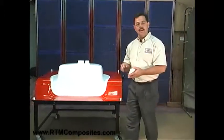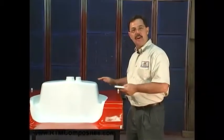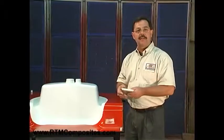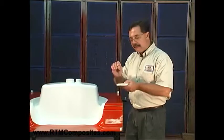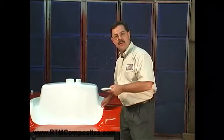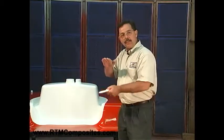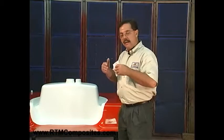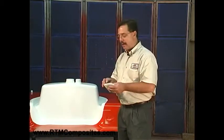The type of fiber that we use is critical. We can't simply load in cloth or different fibers that may be attractive for physical purposes as far as strength. We need a fiber that fits the cavity cross-sectionally, a fiber that will touch the gel coat and touch the upper mold when we close it down. You must fill the cross-section of the laminate, and this helps to control the resin flow front. That is a very critical part of the process.